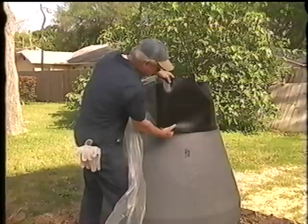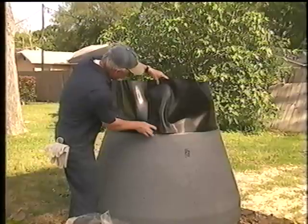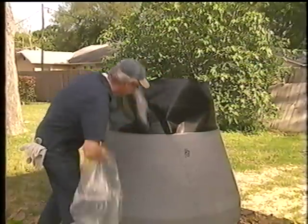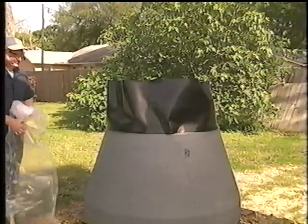At the sleeve overlap, ensure the top and bottom edges of the sleeve are uniformly aligned. Please note that the sleeve does not have to be tightly wrapped since the sleeve material has a high expansion ratio and inherent recovery.